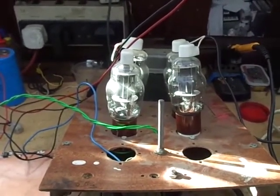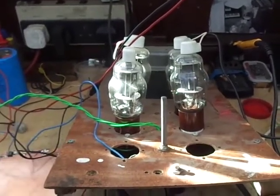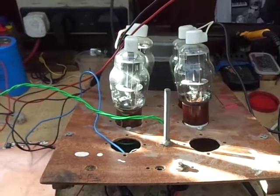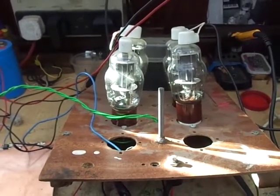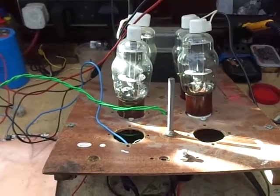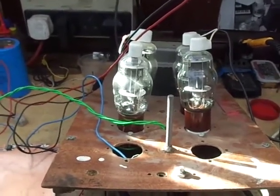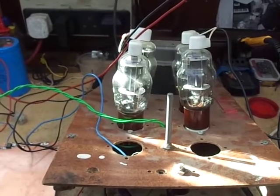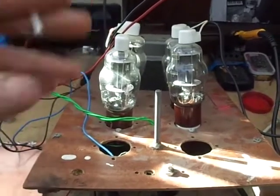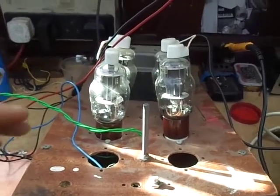I've already done an EL34 amp and I've had these 807s knocking about for ages, so I decided to use those. Straight away there's a design consideration that isn't particularly correct — I've just chosen the output valves because they look nice, not because of their technical specifications. But all in all, an output valve is an output valve. It's capable of high current at a high voltage, and the output transformer and other circuitry has more impact on frequency response and harmonic distortion.